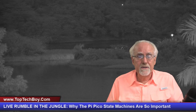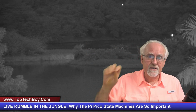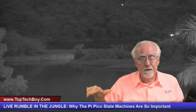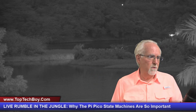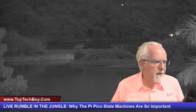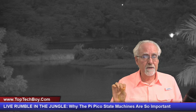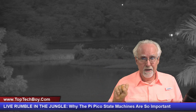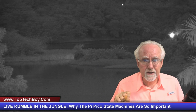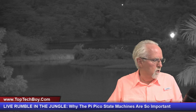It's all sharing the resources. The thing about a state machine is it is totally separate hardware that is dedicated to doing nothing but the specific job that you have given it. And so that is what is special about it. And what we are going to do is write our first program today so you can see how you access those 8 state machines. How do you take advantage of them in your programs?